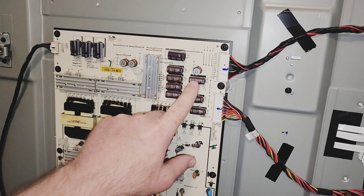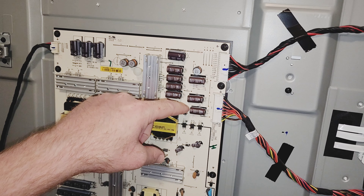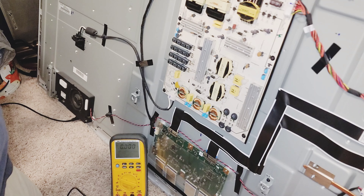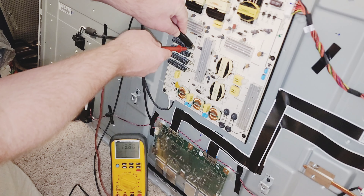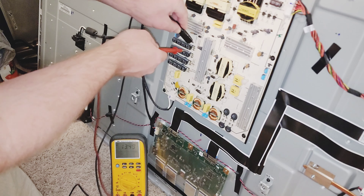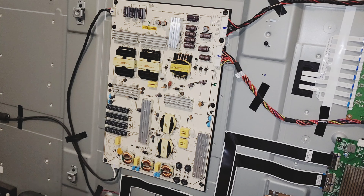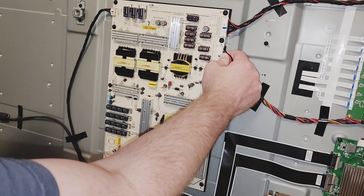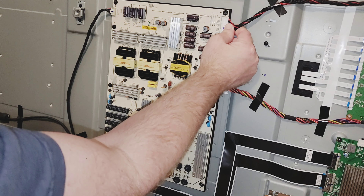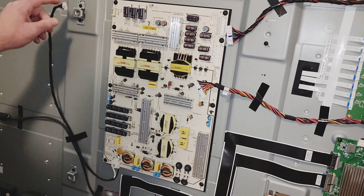Replacing all these 16 volt 1000 microfarad capacitors — there are seven total — and then this transistor right here, U201. I've had this power supply sitting here for 20 minutes now. Let's see if the high voltage capacitors are discharged yet. We're at 13.5 volts so we're good to go ahead and take this power supply off. It's not going to hurt us. Just got some screws and wire harness plugs to take off — get your thumb on here and squeeze in order to unhook it and wiggle back and forth to get it to come off. And then down here.